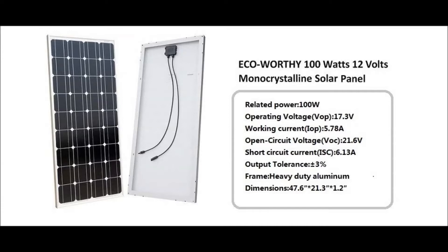Since they are monocrystalline and perform better in heat, these panels are projected to last up to 25 years. I bought a 100 watt panel to keep the cost down and ensure it had enough capacity even on cloudy days to charge the batteries. My backyard faces south, which is perfect for solar, and Las Vegas has an average of 294 sunny days per year.